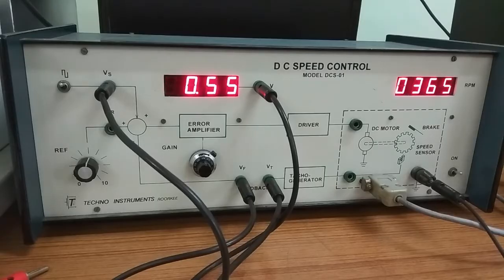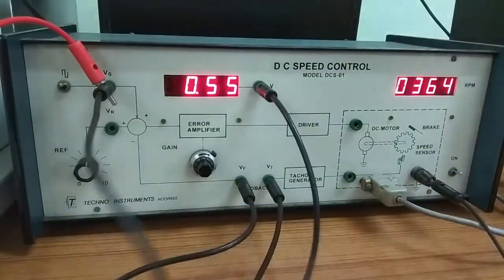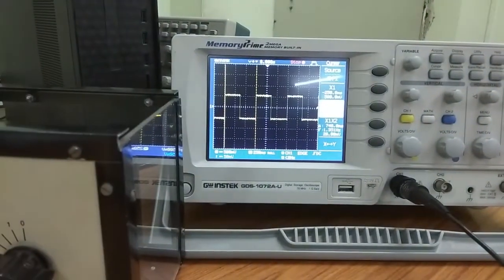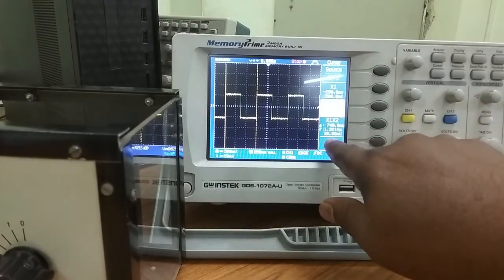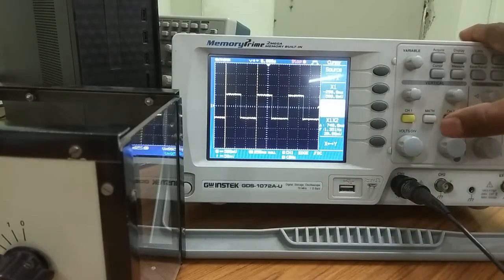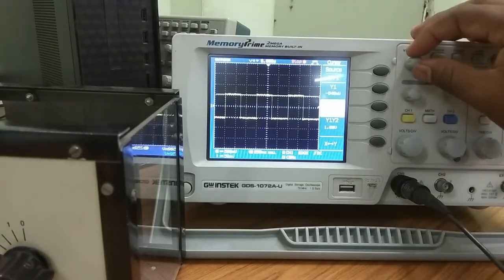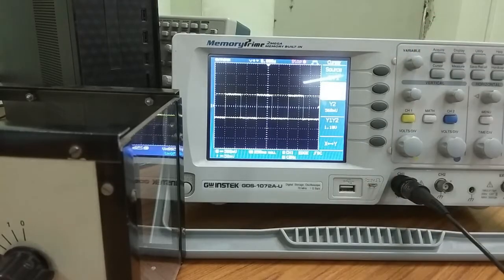When we turn on the square F signal, you can see the amplitude varies from positive 0.5 volts to negative 0.5 volts — that means it is a 1 volt peak-to-peak square wave signal. Measuring with the oscilloscope using cursors: amplitude is 1.1 volts and frequency is 1.3 Hz.